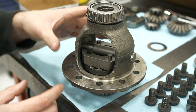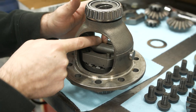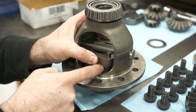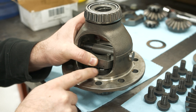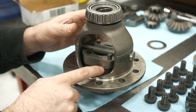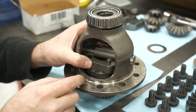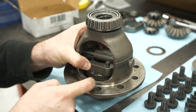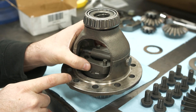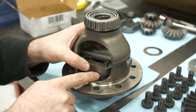Here's the gist of how this locker operates. This upper plate here is controlled by the center pivot pin. When it's in the center, it can freewheel the outside. But once it locks in, this can rotate up against that pin and then it can't lift off anymore — so then it's locked. It will be able to ratchet to the freewheel position or the lock position.